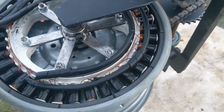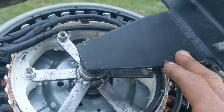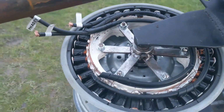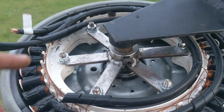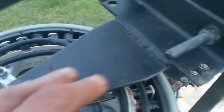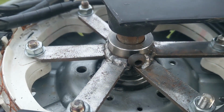It feels quite cushy. Now I'm going to fix the rectifier here, somewhere, and I'm just going to wire those 3 up to the rectifier and then send those down the pipe. We'll see if we can get anything. I'm actually going to loosen this bolt here and turn the stator all the way round, so that instead of the wires coming out the bottom floor side, we want the wires coming out top side. So that should be simple.